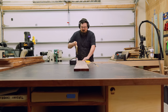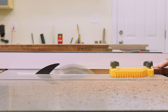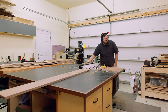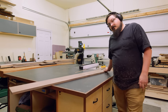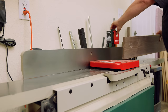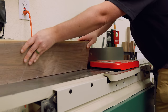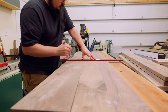That's not to say all these boards are going to be perfectly flat — there's probably going to be some with a twist or bow that I'll have to work out, but for the most part they're mostly flat. The biggest thing is to choose boards at the lumber yard that are mostly flat, and after a bit of time you'll figure out which boards will work. Either way, these panels are going to be three-quarters of an inch thick, and I'm going to use dominoes to keep those panels flat and reference all the faces, so even if there's a slight bow, the combined strength of those joints should level everything out.